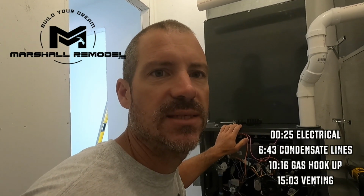And then I screw this in, so when I'm screwing my seal on through the roof, it's going into something really solid. So now I'm just going to run my pipes through here and figure out where I need that. Alright, so now we're going to glue the bottom of this together and stick it up through. Get it strapped down here so it stays, and then we'll go up and seal all that.